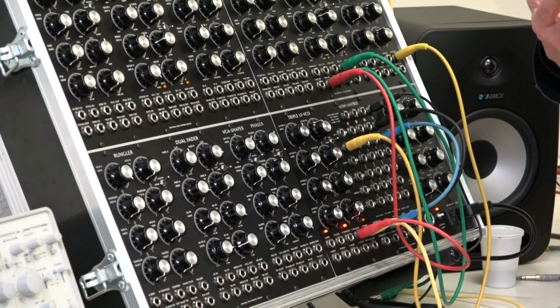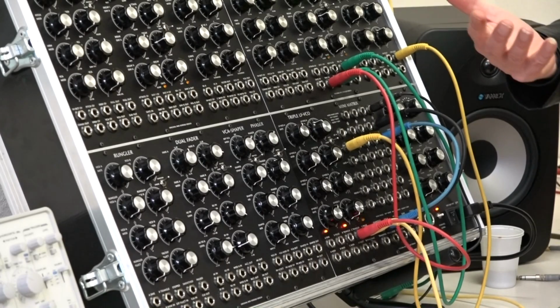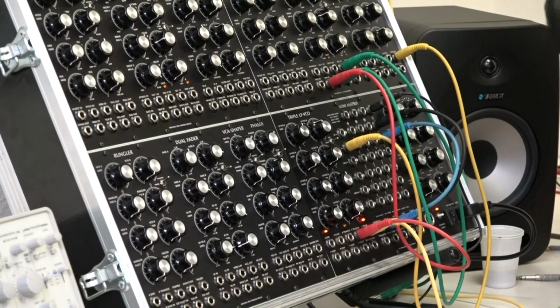To go deep in this, it's a matter of statistics. You actually change the statistics. Because if you do frequency modulation, then the pitch relationship between both frequencies has a certain statistic property. But if you use the sample and hold in between, you actually change that statistic property, and the chance that you have a high and low value is equal. So it spreads out much more.